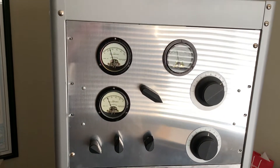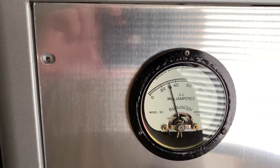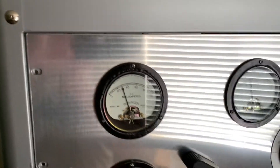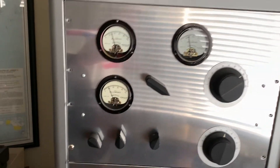It's transmitting fine now. If I turn the audio gain up — I've got the mic way across the room here, that's why it's doing that. I don't want to use it without that Keep Alive supply because my negative peak is going to hit the baseline. Let me show you that it still works fine.